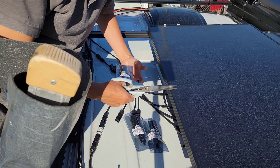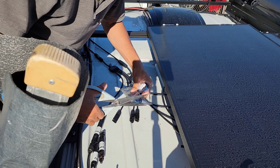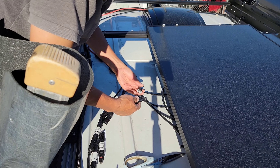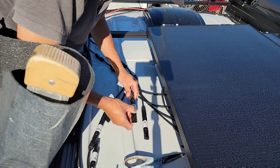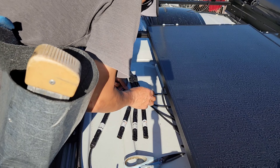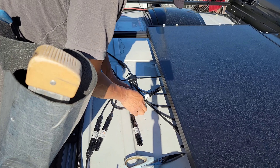Fuses for our solar panels — each panel is going to be protected with an individual 15-amp fuse. These are 150-watt solar panels and each is protected by an individual fuse. So whatever happens, if something is going to break on the road on your panel, it's going to be just that one. It will not burn your wire or short any other panels if any individual one shorts out.